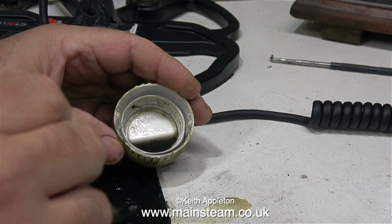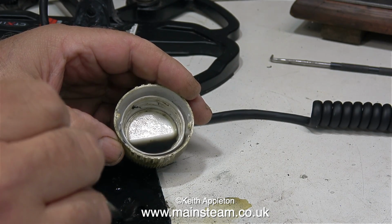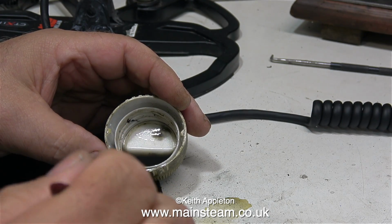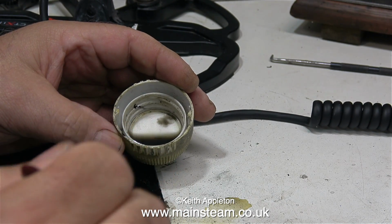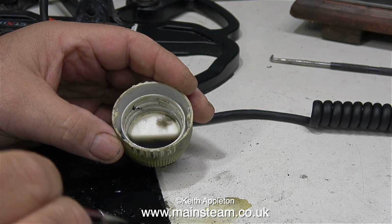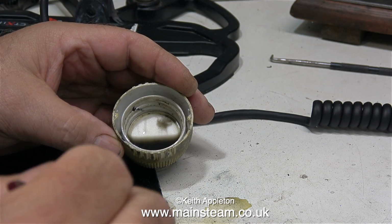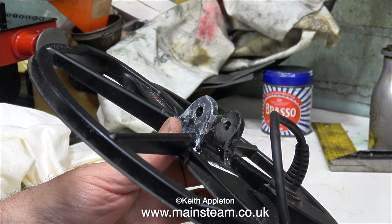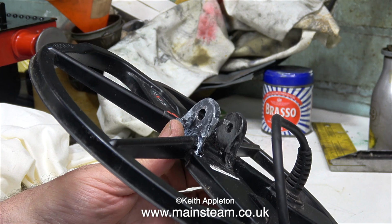But the glue's quicker. In my left hand is a polythene cap, and in this cap I have a little acetone. And as you can see, as I brush the acetone onto the ABS parts, when I put the brush back in the pot, you will notice that it's transferred some of the ABS into the pot of acetone. I thought this was going to work and make it look really nice, but once it dried, it left it a very pale sort of colour.